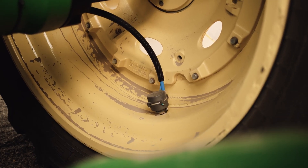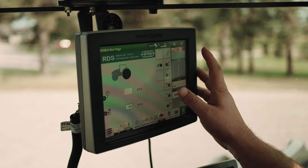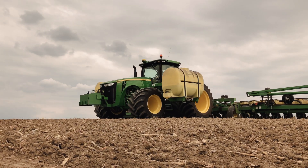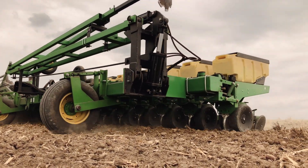I explained to this customer that the proper way to do this is to go ahead and put a central tire inflation system on his tractor, which is going to allow him to inflate these tires to the max PSI to safely go down the road. Then once he gets into the field, let that air pressure out and get it down to the bare minimum tire pressure based on his speed and weight of that rear axle, which is going to create a larger footprint on these tires and fully utilize them without causing any damage — protecting his investment.